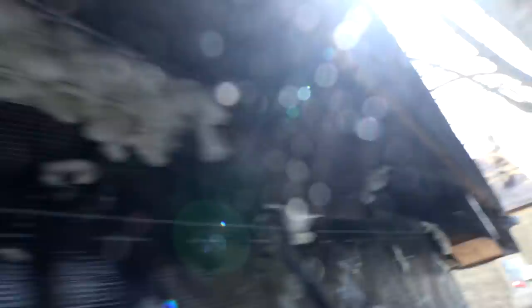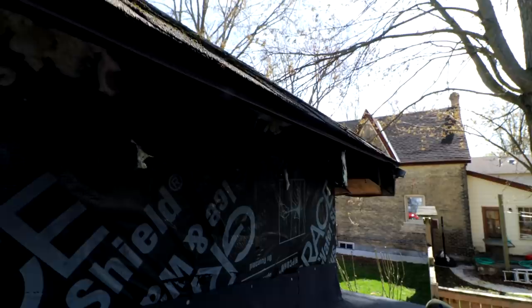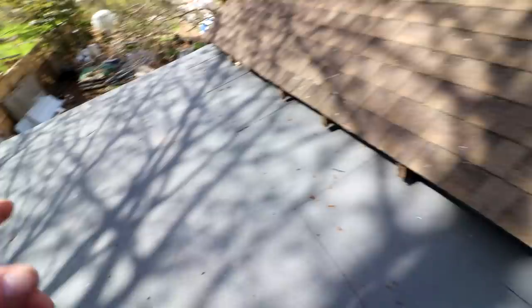Still to do on this roof: I have to put the fascia across here and then mount another eaves trough, because there's a lot of water flow on this roof and all this water just comes down to one eaves trough and it's too much — it overwhelms it. So I need one going all the way around and that'll feed to my other water barrel, so I'll have both of them getting filled at the same time. Everything else on the roof looks in good shape.